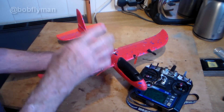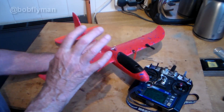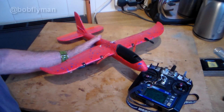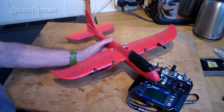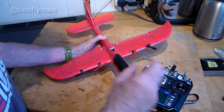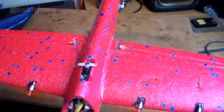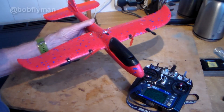So I came up with the idea — okay, never mind, let's turn it into aileron/elevator. The little FS2A receivers will work on 5 volts, should be fine. Was it fine? No, it wasn't — again just wouldn't fly. As you can see in these clips here, it kept diving off to the right or left when you opened the throttle past about halfway. Back at the ranch I discovered why: as I was opening the throttle, this aileron servo here was actually involuntarily moving and swinging the thing into a hard bank.